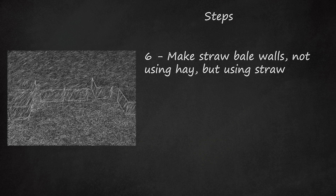To build the wall, you start by sharpening some staves — inch-thick willow stems — and then securing them vertically in the wood or concrete base; you will need to drill a hole, or perhaps poke them in when the concrete is still wet. Bales should then be further reinforced with U-shaped willow stems that must be bent while the stems are green, or use another kind of straight staves and bendable pipe for U-shaped ones. To make U-shaped staves, select a one-meter willow stave and mark the stave at 33 centimeters (one foot) from each end. Take a big hammer and bash the green stave on these marks until the fibers of the wood are mashed, split, and softened. These bashed areas are then bendable — bend the stave into a U-shape and then get to work.